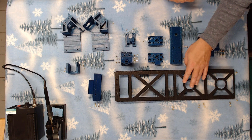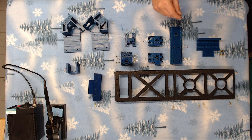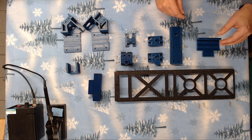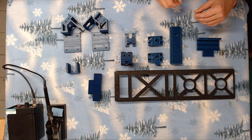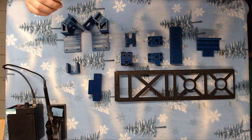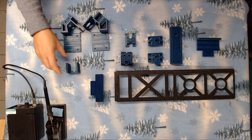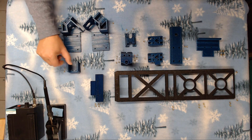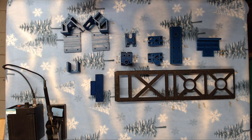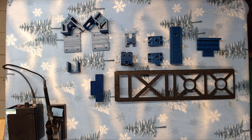Now you don't have to mount the four for where the Duex board expansion board can mount, but while you're putting all of them in I figure go ahead and put them in — that way you don't have to worry about it later. After you've got everything wired up you can just install your board and continue add-ons if we ever get to where we can do a tool changer with this. The switch housing takes four, and then your hot end mount and cooling fan mount actually takes six metric M2 heat sets. I'm going to go ahead and start installing all these heat sets.